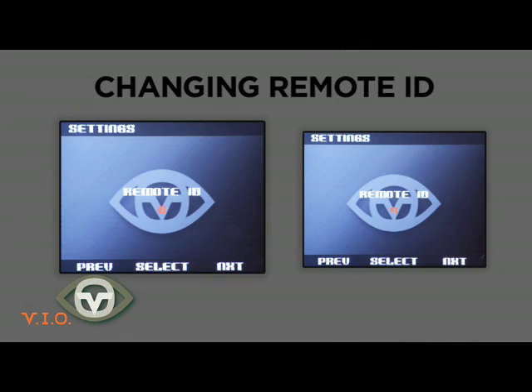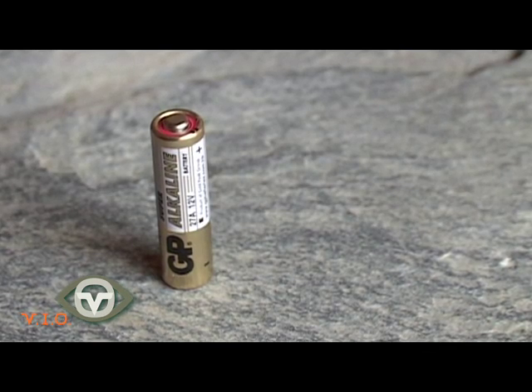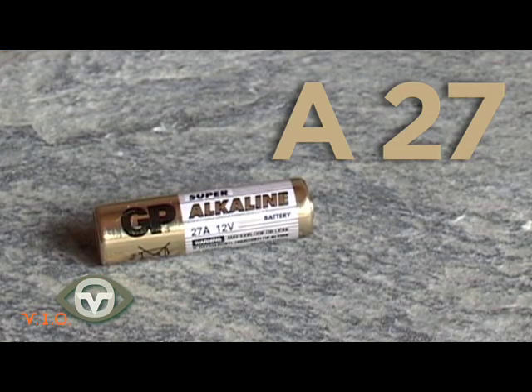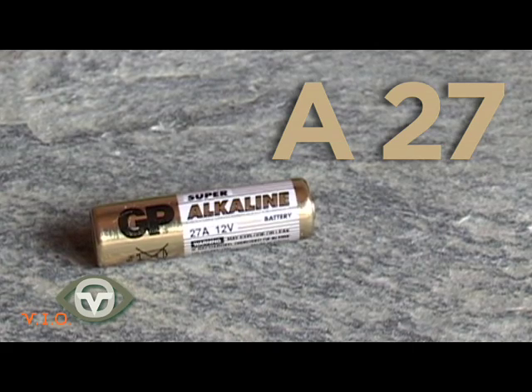When selected, go into the menu settings on the recording unit and change the remote ID. The remote control battery will last 2–4 months with heavy use. The remote LED will flicker and the signal will also be weaker when the battery is low. The remote control takes a size A27 battery and can be purchased online or in any good electronics store.